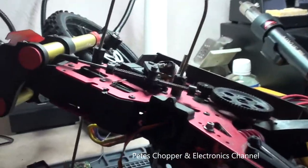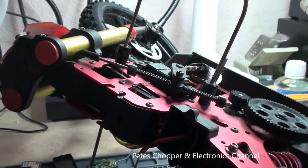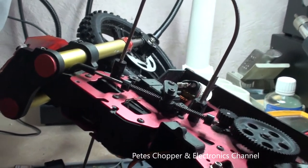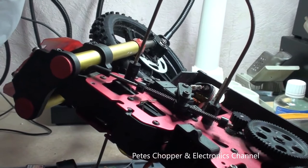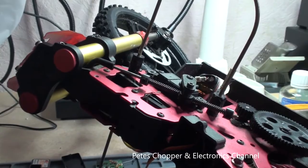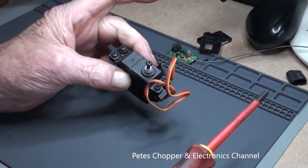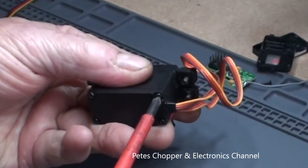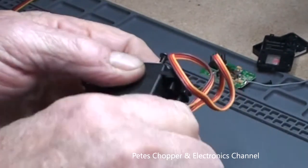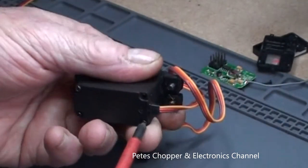So the servo's knackered - I would say shorted out, open circuit MOSFETs. Everything I've tested so far: the RX is gone and the servo is knackered. It's just driving to one end and taking maximum current. I don't expect to repair this - it's not economical to repair it, put it that way.